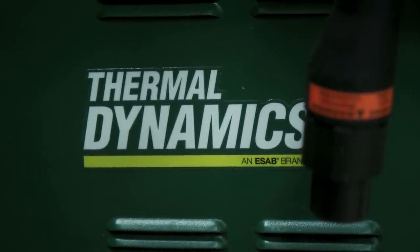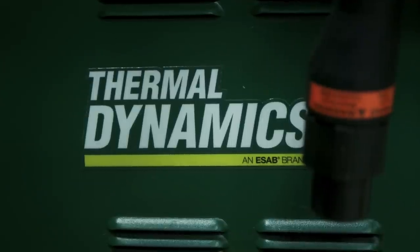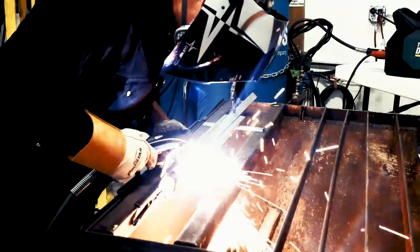The plasma cutter is a really nice little device — it's a Thermal Dynamics by ESAB, a Cutmaster 40, and you could use this right in your backyard or garage. I used a piece of angle across the plate as a guide to steady my hand and make the cut nice, neat, and straight. There are multiple ways you can bevel — oxy fuel, but not with stainless. On stainless, as well as aluminum, you can only bevel with a grinder or a plasma cutter.